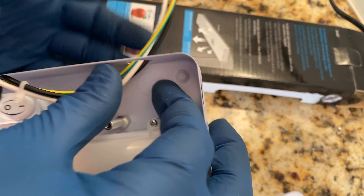The hot wire is done. Now let's get the neutral wire — connecting neutral wire here. Then the last step is to connect the ground wire. Looks like I did not connect it properly, so I'm going to do it again — just making sure I hold it at the end of the tip, then both wires go in. I'm still not happy with the connection, so we'll just do it this way.